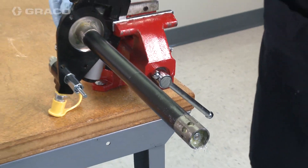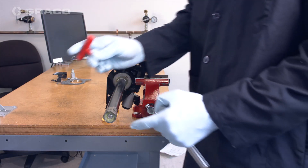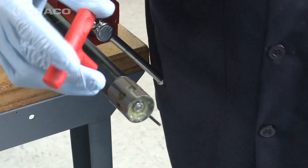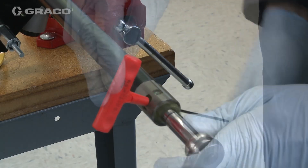Push on the end of the pump rod to gain access to the cross hole located at the end of the shovel rod. Place an Allen wrench or similar tool through the slot of the shovel tube and into the exposed cross hole to keep the shovel rod steady.